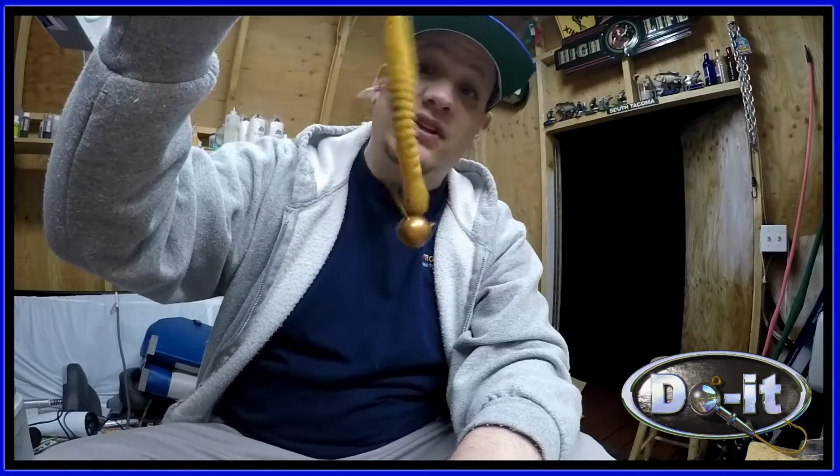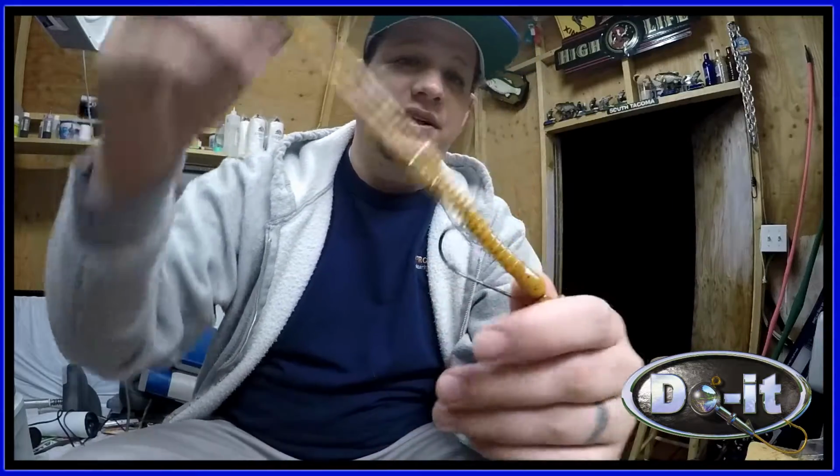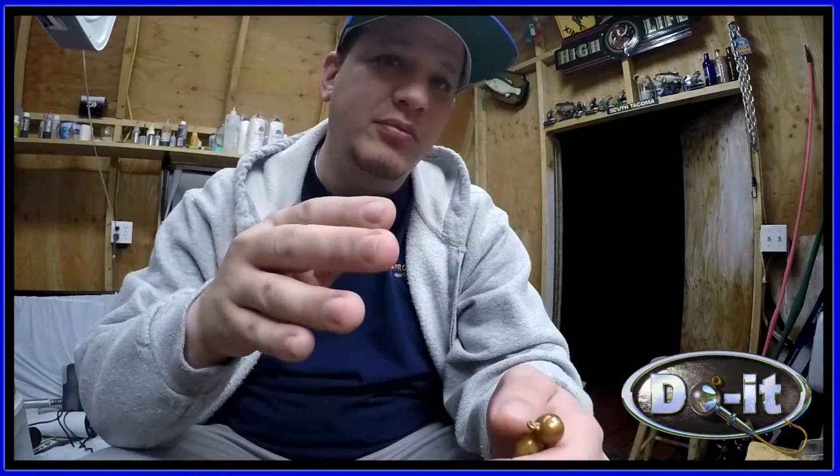Shaky head is definitely an awesome technique. Great way to fish, fill your live well. If you're looking for a shaky head mold, this one right here is definitely an awesome one to get. Just be careful when you're pouring. Make sure that all of the hooks and the Screw-Locs line up straight, so when you shut the mold, it completely lines up and completely closes. And when you're pouring, make sure you put a little bit of pressure on it.